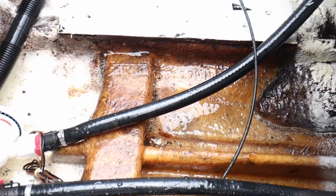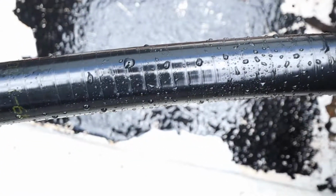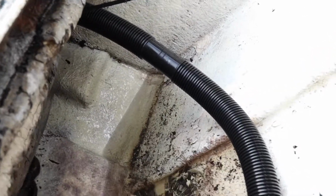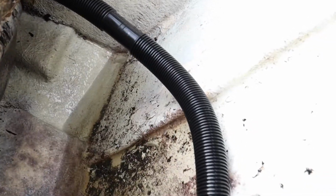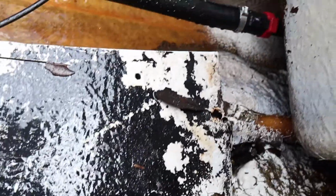As y'all can see, we got this a whole lot cleaner than what it was before. Still gotta vacuum out some areas, but for the most part, we got it cleaned out. We about to drop this overflow down, this big hole right here. We gotta change that fitting for that hose right there. That's gonna be one of the bilge out hoses. We're gonna change that to a three quarter fitting, and back in the back of the boat, we'll be pretty much done with cleaning this area up.